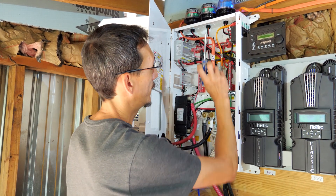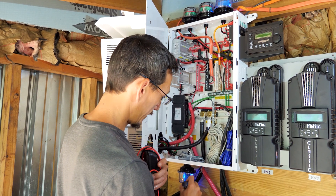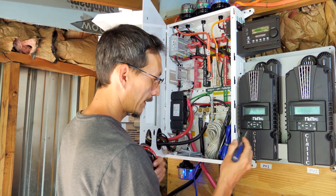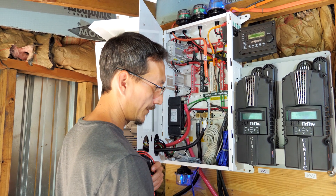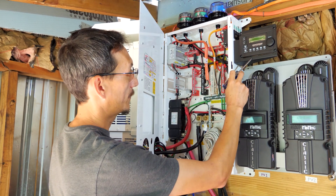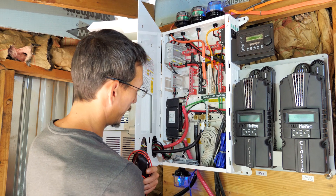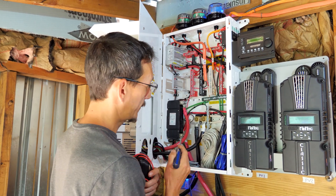That covers the input of the solar, and then it will go to the charge controllers. This would be the battery temperature sensor that just sticks onto a battery — that allows the charge controller to modify the charge based on battery temperature. If these were flooded lead acid batteries, that would be a bigger issue, but because they're lithium, you don't really have the temperature sensitivities. You just can't charge these batteries below freezing. This cable here is the remote cable that allows the remote control for the inverter to work. This data cable is the battery temperature sensor for the inverter, which is over here on the negative terminal. So there are two battery temperature sensors — one for the inverter and one for the charge controllers — because the inverter also charges.